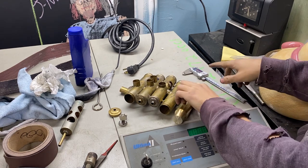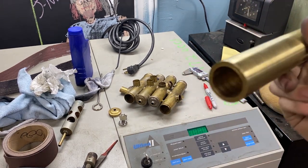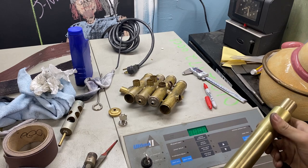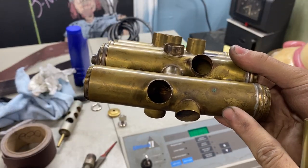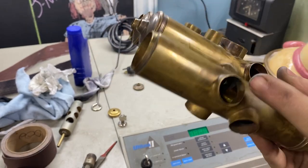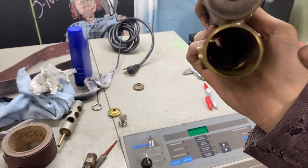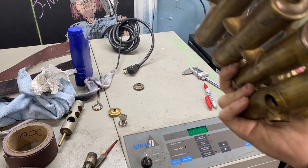I cut off the drilling because I messed up the first half, but I flipped it around and got my part out of it. So I got a hole drilled in there about five inches. This entire piece is probably about seven inches right now, so the hole ends about there, which is fine because on our casing we don't have a hole for about two inches here. So we can come back later and finish boring that out. Basically, we have four holes to drill. Three of them are standard 120-degree spacing, and then the fourth one splits it so it's 180 degrees off the first one. Pretty simple.